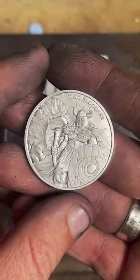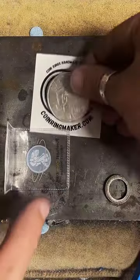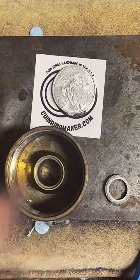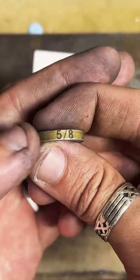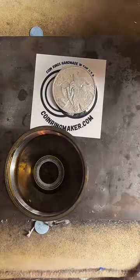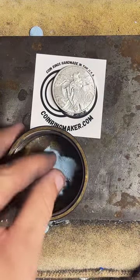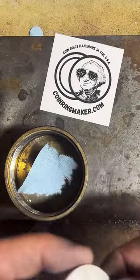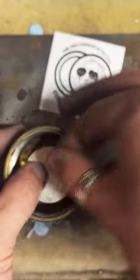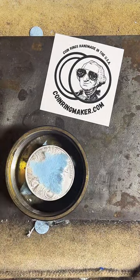The first thing we need to do is punch a hole in the center of the coin, so we're going to prep our auto punch. This is a larger round — a one ounce fine silver round — so I'm going to be using a five-eighths inch punch. I usually use a half inch, but I think this larger one is going to work out a little better. I'm going to put down a little bit of blue shop paper towel on each side of this to help protect the detail. You really don't want any metal-on-metal contact — it'll mar up the details.